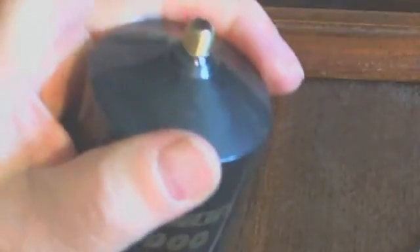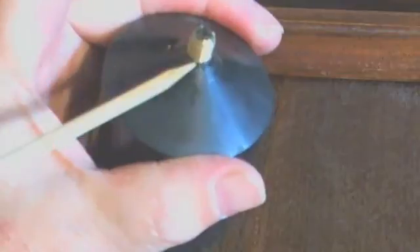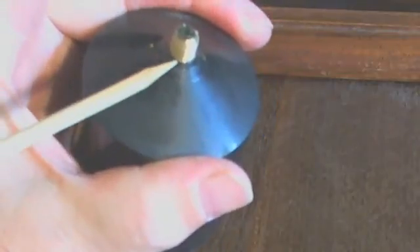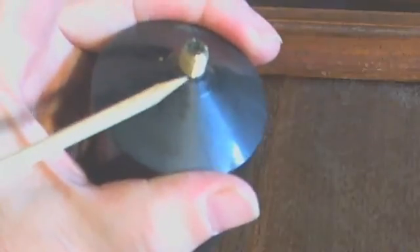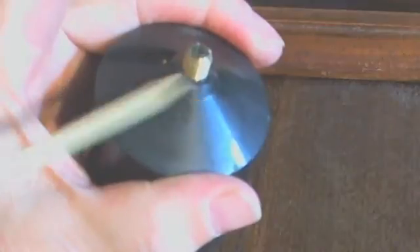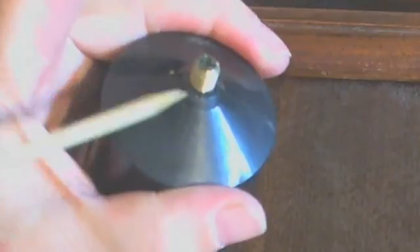So the water could go down in there — rain comes right down, gets on the stinger and goes right down through that hole. It's just going to go right down and sit on top of that stud right there — that little threaded stud that brings the current up into the stinger. Now the only problem is, if you look real close at this one right here, I see some little remnants of glue around this spot here around the threads.